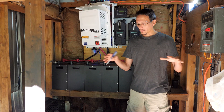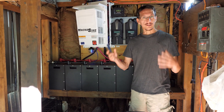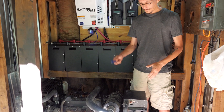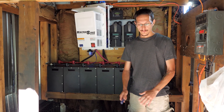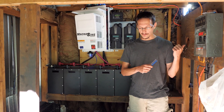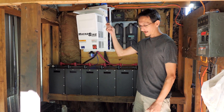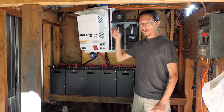Before I start, I'm going to go over a quick overview of our whole system. In the event that our solar is down — no sun, no battery, no anything — we always have this diesel generator. This is a 10-kilowatt diesel generator. I've rewired it; it actually does put out 240. It was previously wired for 120 directly to the load center that runs the camp, and it also had a battery charger hooked to it for our old batteries. So I've rewired it to use all of it — 240 with 3-conductor 10-gauge Romex that goes directly into the power center, so we can bypass the inverter and the whole solar system and run directly off generator if we need to.